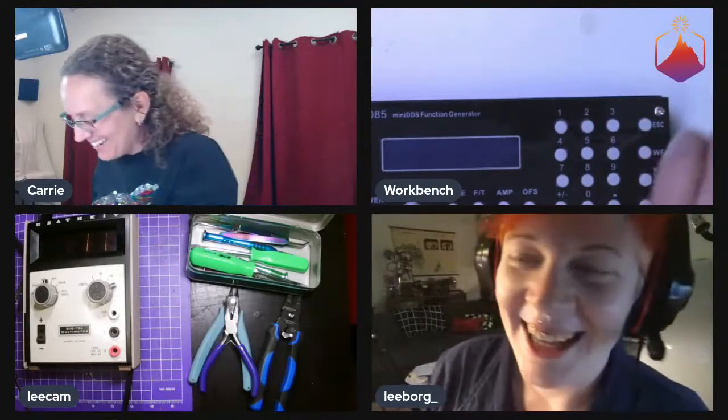But so you know, what is a waveform generator kit? Maybe you give a basic explanation for folks who might not know. Yeah, it generates waves. Sweet. Waveform generator generates waves. So it generates a repeating signal, and it could be a sine wave, so a very roundy, smooth wave, or it can be a triangle wave, or it can be a square wave, or it can do pulses, and you can tell it what frequency. You can generally do amplitude a little bit. You can offset it so it can be symmetric around ground, or you can offset it so it's 0 to 5 volts. And you can do stuff with square waves like that you might want to use a waveform generator in.